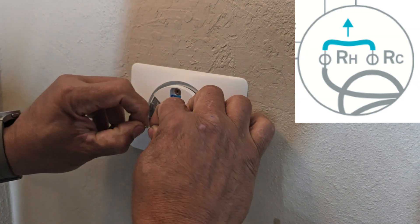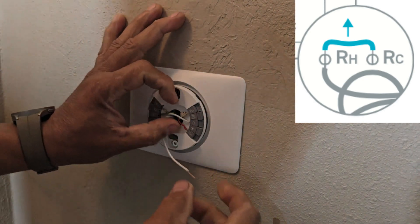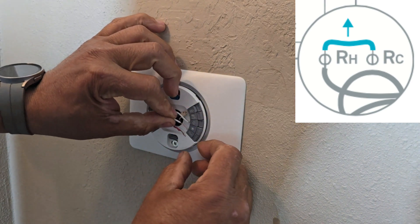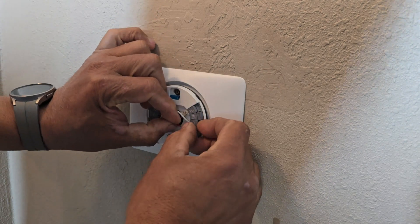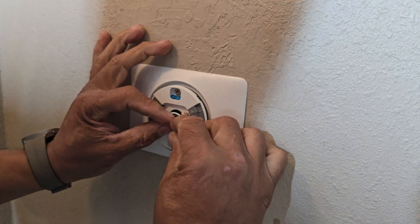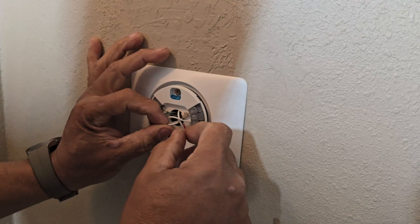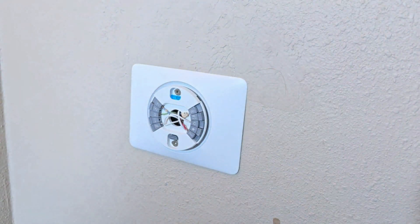If we can get those two together, press that down — here we go. So we have that in there and we're gonna do the same thing for the red RH. I'm gonna push this one in first because it's a little softer, then try to push the red in — it's a harder wire — so there we go, that works. We can push all the extra stuff inside. That bridge is to make sure that the air conditioning and the heater work; if not, you're not gonna get both things to work.